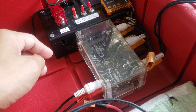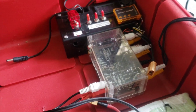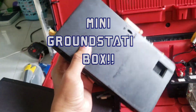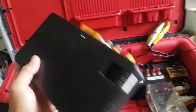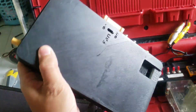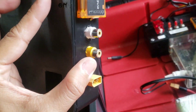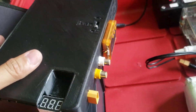For the inputs to this Eagle Eyes module, I have two ReadyMade RC video receivers. One of them is inside this smaller ground station relay box that I have made. I carry this around when I don't intend to do extra long range flights or if I'm just going to fly short to mid range — this relay station box is sufficient enough. It has its own DVR output, and I can just connect it to an LCD monitor or to my goggles directly through wires.